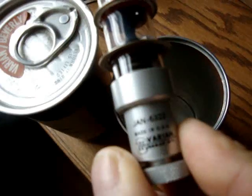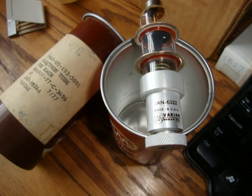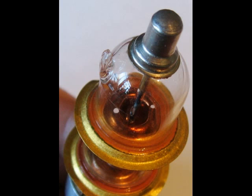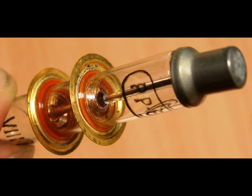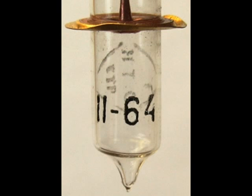It's still packed. I'll open up this one. Now, look at the comparison between Russian-made and American-made. This is the Russian-made and the American-made. You see the handle on the American one; the other one has a screw — the screw is a terminal in here. Basically they are the same, the same diameter. The heat sink is extremely important. There are two copper discs that you see here — those are the sides of the spark gap, and they're supposed to be connected to the heat sink.